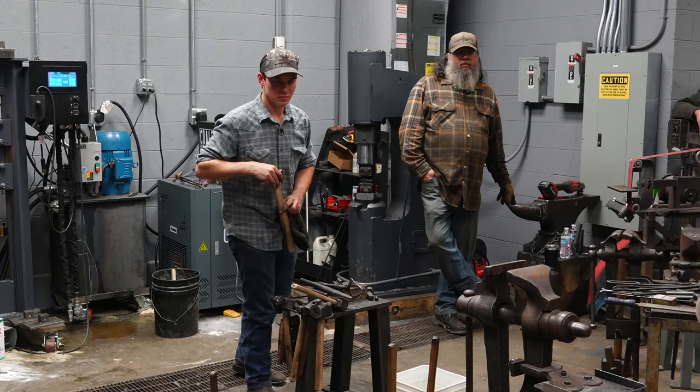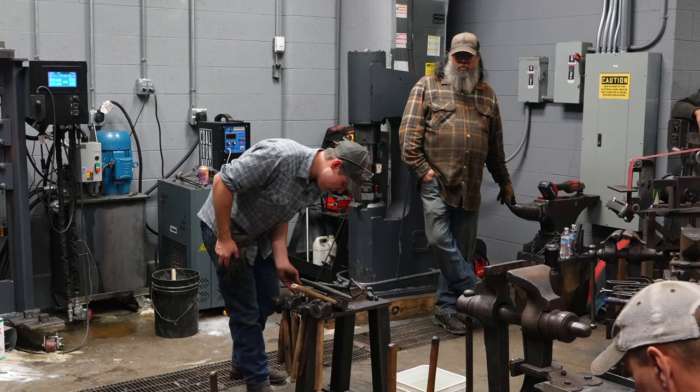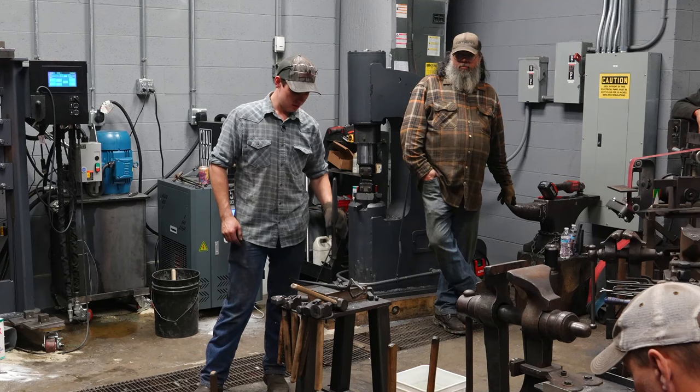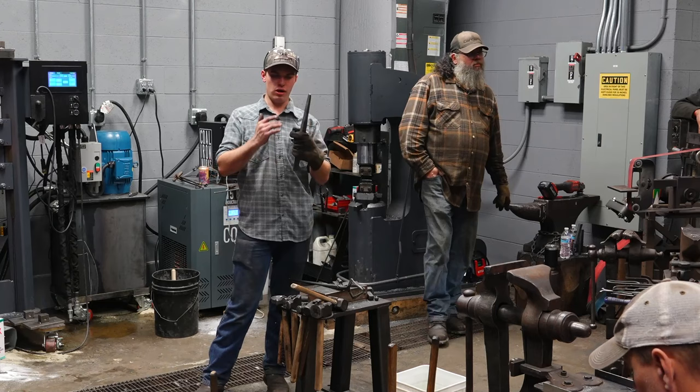How many hammers do I get out of one drift? With a striker, if I take really good care of the drift, I get hundreds, really. You get hundreds of tools. The drifts I usually use, maybe 50 under a power hammer. They get crushed over time slowly. And those are S7 drifts.